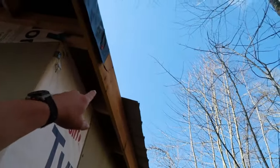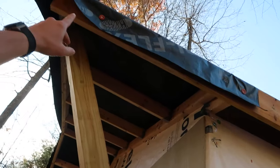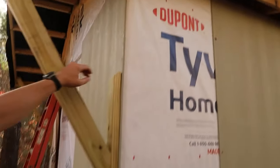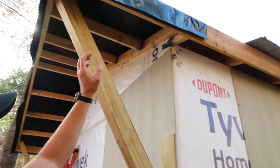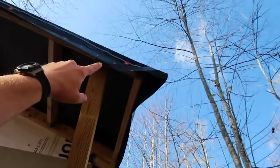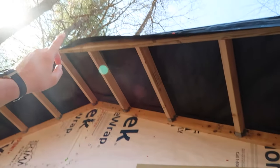So I have the metal roof all the way to this point right here, and it's time to extend it on over. Now I don't think it's going to need a full piece to get to the edge, so we will have to bring out the angle grinder and bring that down some. So let's go ahead and hop up here and get the last piece on this side and see about cutting down what we need for the end. And then we'll be working on the rake trim, which goes on this edge here. And then we have the ridge cap and we will be done.